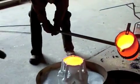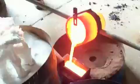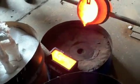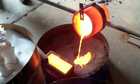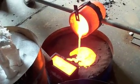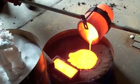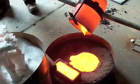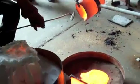You'll see the bronze pushing the air out, rising up through those little risers around the edge of the mould. You can see that the bronze has poured successfully through the whole of the mould — the bronze came to the top. Then we pour some excess into an ingot. On this occasion I'm making a simple circular base, pouring the remaining bronze into some slightly damp sand. You can see that lug on the ring shank — that stops the crucible from falling out as we turn it over to drain the bronze out.